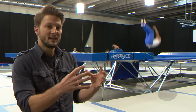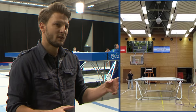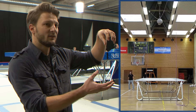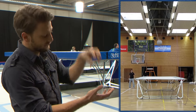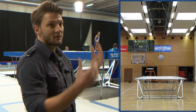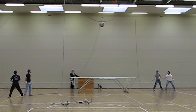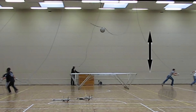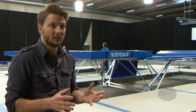That's why we use a steel ball instead of the human body for our tests. We take the steel ball and drop it from four meters above the bed, then watch carefully how deep the ball dives into the bed and how far it rebounds. If the deflection of the bed is between 92 centimeters and 99 centimeters, and the rebound is between 3.1 meters and 3.35 meters, then this part of the requirement is fulfilled.